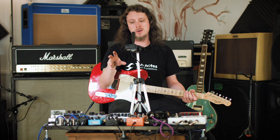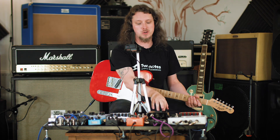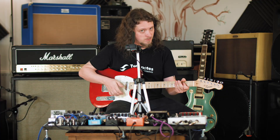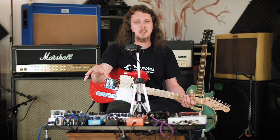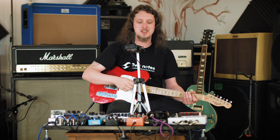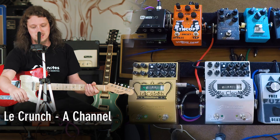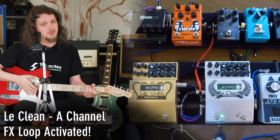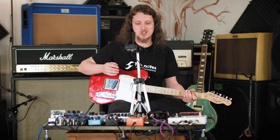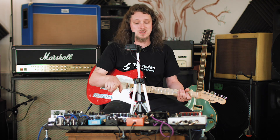Now, the clever bit about these effects loops is that when I switch to another one of these pedals — say I turn on the Le Crunch — that effects loop is then off, so we're back to being completely dry. What that means is that I can already have the reverb and the chorus turned on, and if I switch to a clean sound I don't have to tap dance on all the pedals — they're just on. So if I go from the Le Crunch sound to the clean sound, all my reverb is there, and then back and it's off again. Having an effects loop on each of these Le Preamp pedals means you can have a choice of effects that come on with a single stomp.